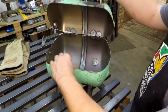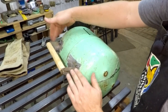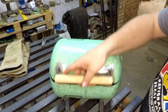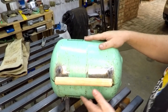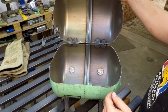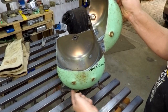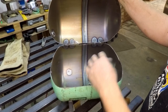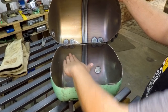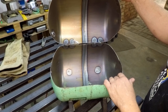The front edges have been cleaned and smoothed so they're no longer sharp, and the two handle side brackets are welded in place. The dowel stick handle is attached and works very nicely. That's mostly it for the shell of this barbecue, except for rounding it off and giving it a paint coat. The next step is to drill a few holes in the bottom for air ventilation so the coals and charcoal can get fresh air to burn, and then to make a grill and some stands for the grill to rest on.